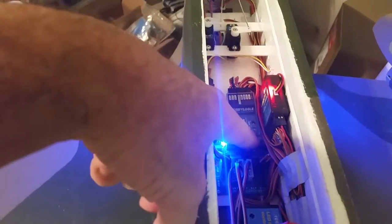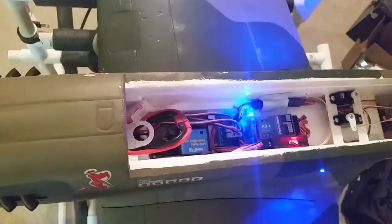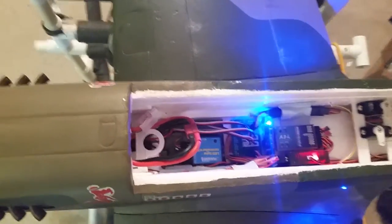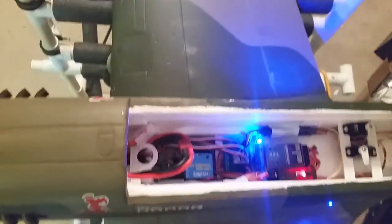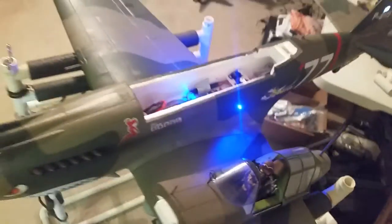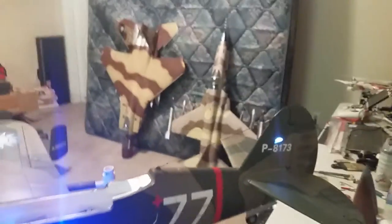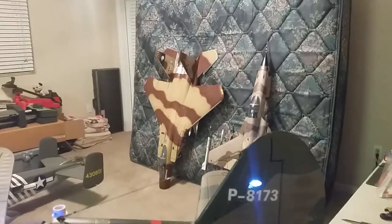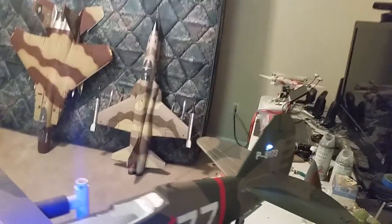There's a separate BEC just sitting loose right there behind it — I spliced it back into the ESC so I'm not using the ESC's internal BEC, which I do on most of my planes. I don't like using the internal BECs unless it's a really small plane. I added quite a bit on this one with the lights — the two side lights and then the rear tail light, which I can program to either strobe, be off, or stay on. Right now I kind of like it on.